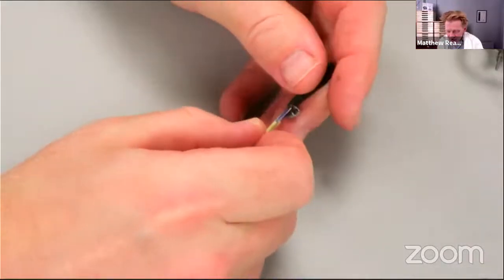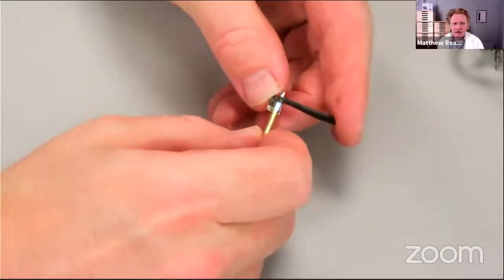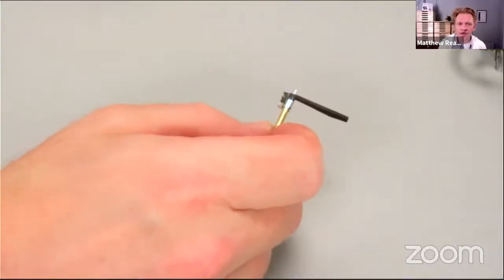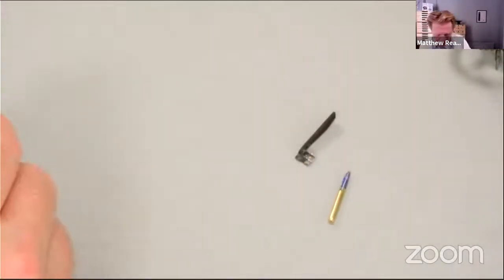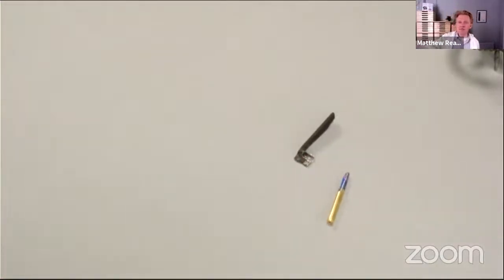And what I'm hoping, lots of hoping here, is that when I solder this in, that'll give me a start to file a new square inside the bit of brass. So it'll be a kind of mix of the brass and the silver solder and the steel, and it'll be a good tight fit. It might not work, but as I said, this is a last chance saloon. So you can see I've got some blue pen on there, and the purpose of the blue pen is so I could see where the two components were touching, so I can get them to be a reasonable fit.